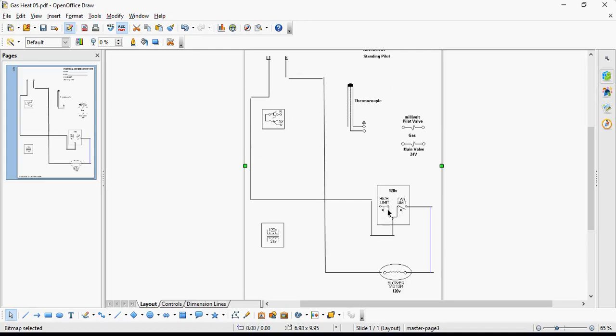Now I want to take care of my other half of my fan limit. This is a normally closed thermostat — at 200 degrees, that switch will open. It's a safety. I want that furnace to shut off in the event of a high-temperature emergency. The reason that would happen is maybe my blower doesn't turn on — it's seized, it has an open winding, it's shorted, something. Maybe my gas valve is overfiring, or maybe I've got too much gas pressure — something that's going to cause that to overheat. I want something there to shut it off safely.